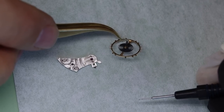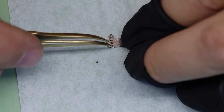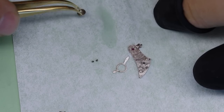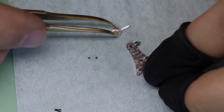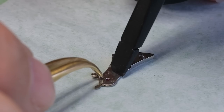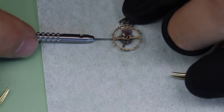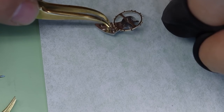To clean the cap jewels in these old watches is a little bit of a hassle — we need to take the balance off the cock, and then we have these two tiny little screws that allow us to get the capsule free. Cleaning it in some Essence of Renata, and if there's any stuck residue, we can rub that off with a little tissue paper. Then we're going to oil it from the underside — you can put the oil directly on the capstone as well. Now the hairspring has a Breguet overcoil, so we need to be a little bit extra careful when we put the hairspring between the index pins.